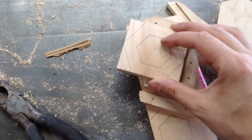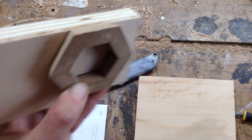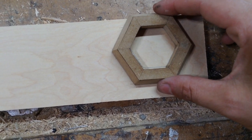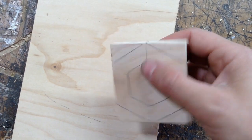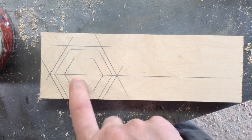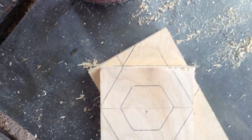This is what that shape looks like drawn on there. I would cut the two sides — if you could flip this upside down you wouldn't need two separate jigs, but you can't because you're also cutting the angle at the same time. I started with the jig, got it to work, and then remade it to get it a little more perfected. I had that angle cheated to the front because that's the angle you need, then traced the inside of the piece. I transferred all of those marks down the side of the piece to use as alignment marks on the jig, and extended my center line down the piece so the second one I make is at the same center point as the first.